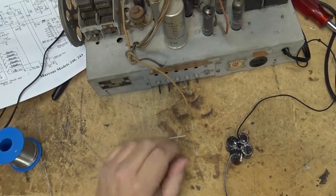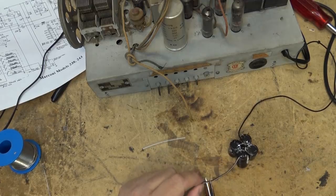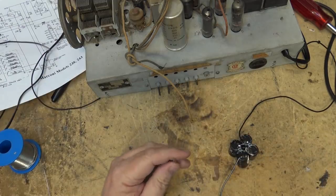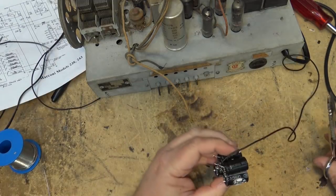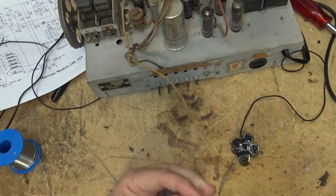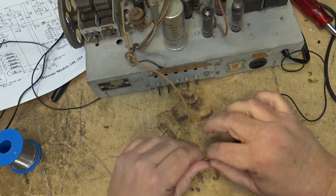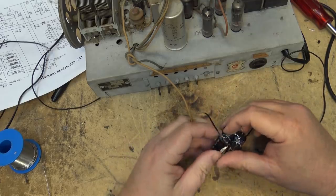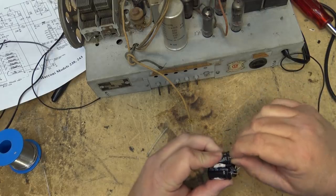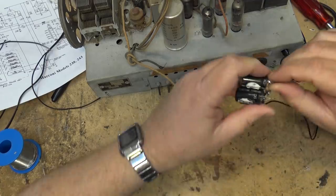So I'm just constructing the four banked capacitors, what it is. So what I've done is I've taken four, I think they're all like 33 microfarad, 450 volt, which will be more than enough. I've taken four of them, and I've just connected all the grounds in common, and then I'm connecting a connection lead to the positive, and we'll put some heat shrink tubing on here, and then this is going to be put in the bottom of the chassis,